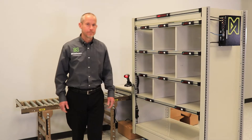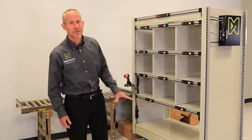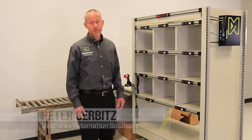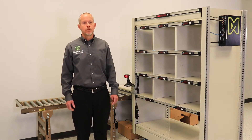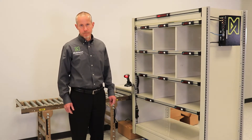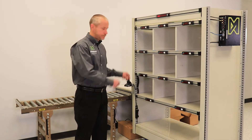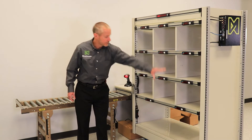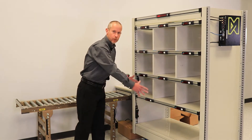Hello and welcome to Promat. It seems a lot warmer than it did in 2019 and the traffic was nothing compared to last time. My name is Pete Gerbetz and I'm with Matthews Automation Solutions. I'm going to talk to you a little bit today about the LP Put Solution — it's a put-to-light solution typically used in e-commerce sortation. With a put-to-light system, large batches of orders are initially picked. These batches are co-mingled and need to be sorted at the put wall. On our put wall here, we have 11 different bins or put locations, so we can accommodate up to 11 orders to sort here.